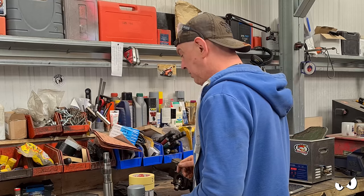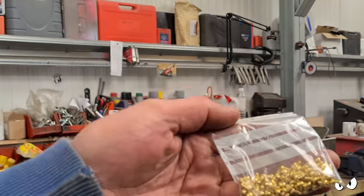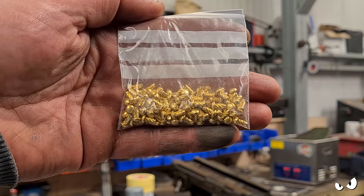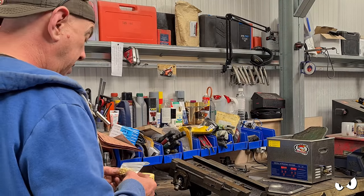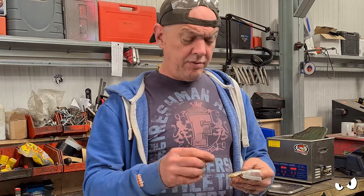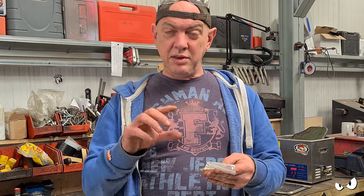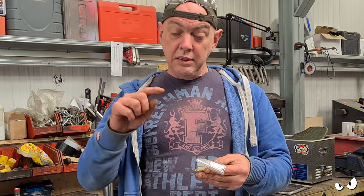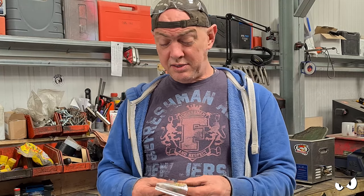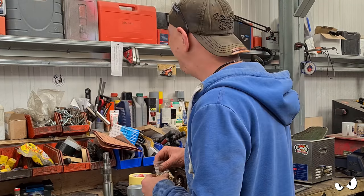But anyway, so all that was going in. I also got some of these jobbies. Hammer drive rivets. Very weird little things, actually. Made of brass. It's like a real short rivet, but it's got a screw thread to it. So as you knock them in, obviously the brass is going to deform because it's softer than what I'm boshing it into, and it'll sort of twist its way in. They're brilliant. They don't want to come out once they're in.